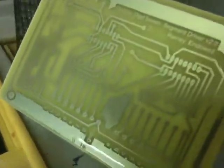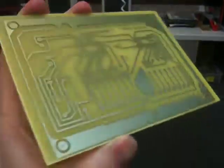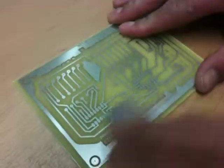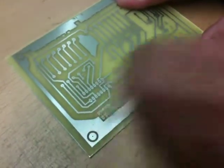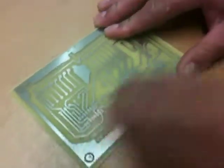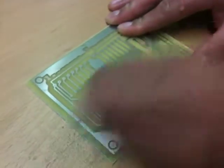So the etching process is almost complete. The circuit board has been fully etched — you can see it there — and the copper remains underneath the unexposed photoresist from earlier. And there it is, all finished. All we've got to do now is clean it with an abrasive block, and you can see that that is actually exposing the nice shiny copper underneath, and it's that, of course, that will be carrying our current later on.